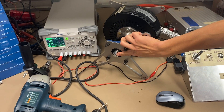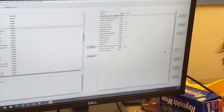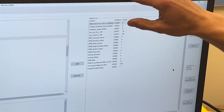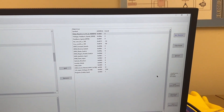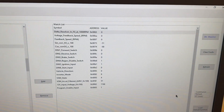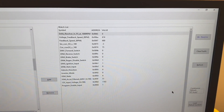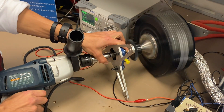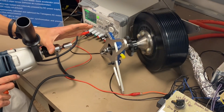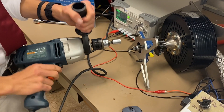We are going to spin it at around 1000 RPMs. What you'll notice is the voltage feedback speed, which is what the inverter is calculating, versus the feedback speed, which is what is actually being induced — these two RPMs are represented in the same magnitude and direction. First, we'll perform the test in the forward direction, which should be positive, then in the reverse direction, where the result will be the same magnitude reflected in the negative direction.